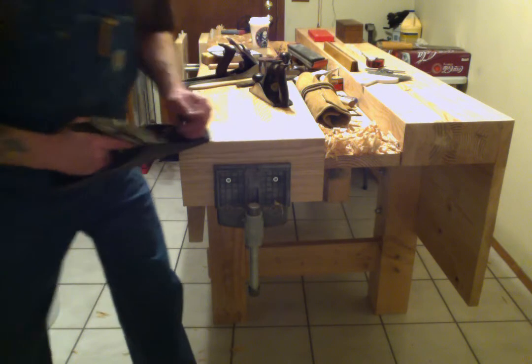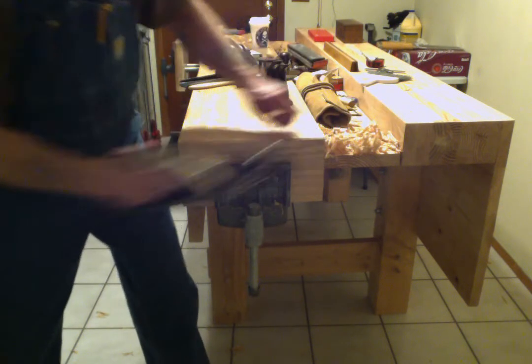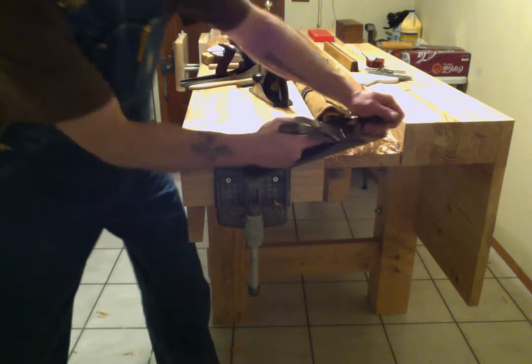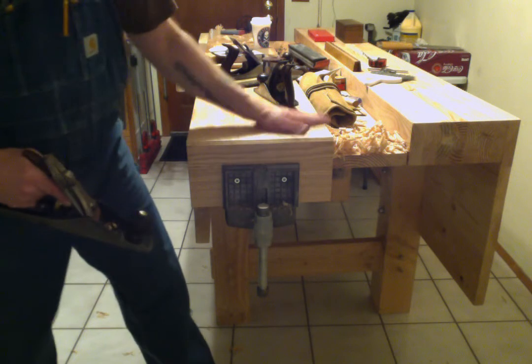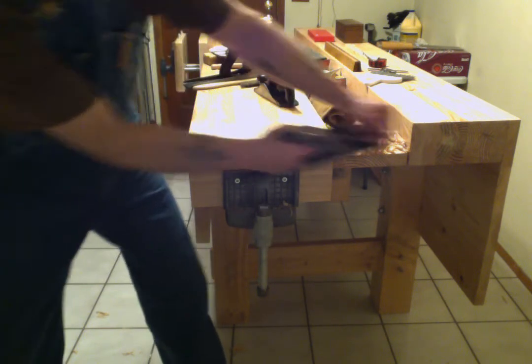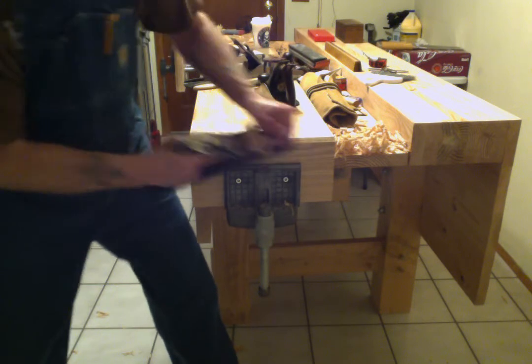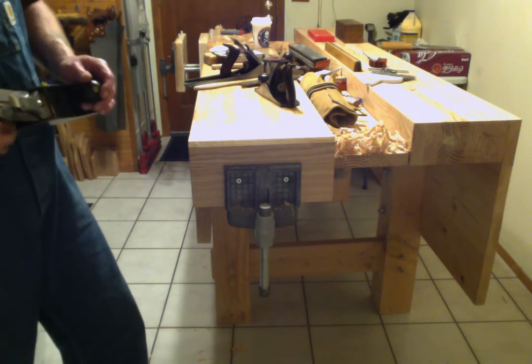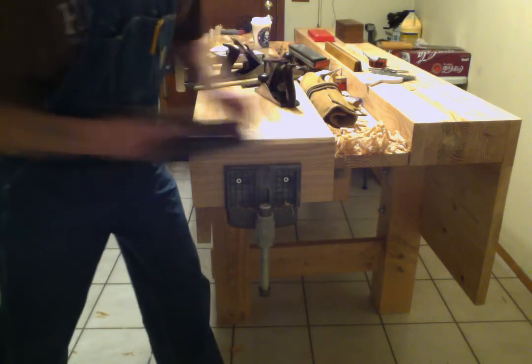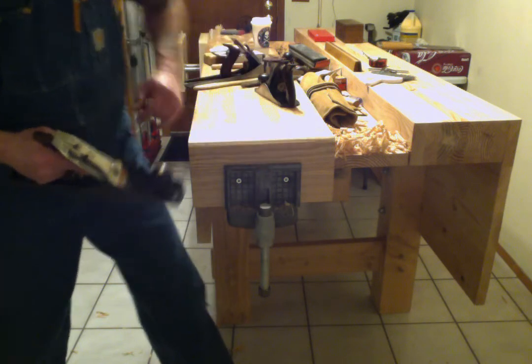Alright. So super heavy cut. I'm just cutting a 45. Try and keep it even. It's really just eyeballing it at this point. And this is really just the shape that we're dealing with. I'm going to back it off a little bit, and we'll start taking that top corner off. Watch your plane so you don't run into your vise.